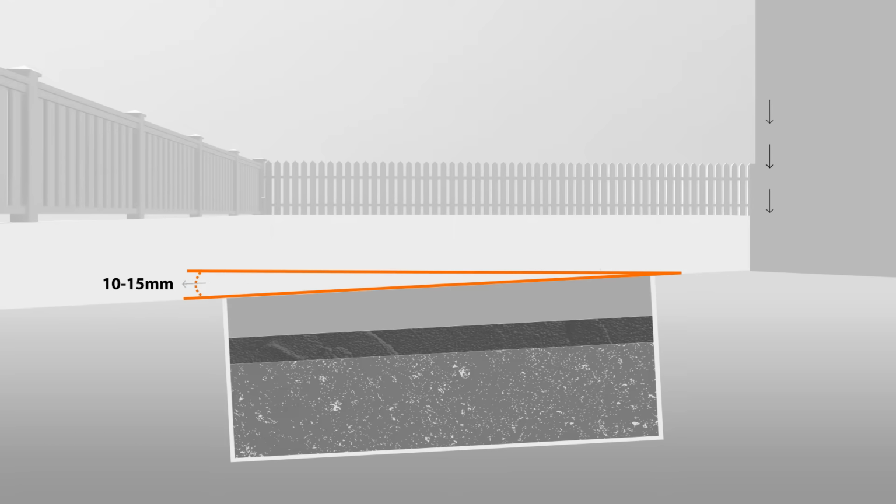Sprinkle small piles of sand along the joins and brush it in diagonally into each groove. Then sweep away any excess sand from the surface of your pavers before wetting it down. Use a fine mist setting on your hose, spraying upwards so that the water settles gently and pools on top. Leave the water to dry naturally and the jointing sand to harden and set everything in place. Right, that's how we lay concrete pavers, and it was easy as.